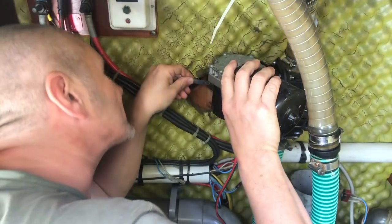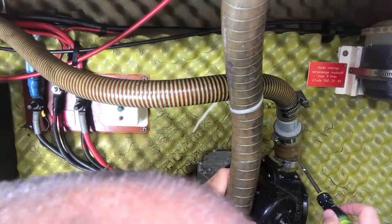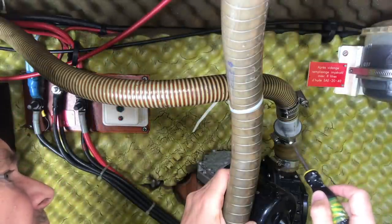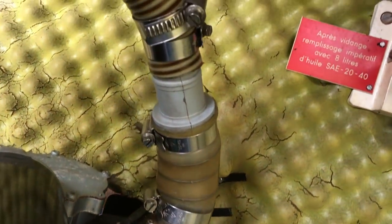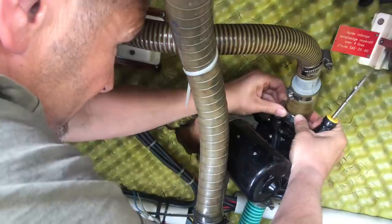Access is really tricky — it's bolted onto the bulkhead but the motor actually covers the bolts. What's a bit strange is there is a bit of an adaption going on here: there's like a reduction pipe here, it goes down from maybe 38mm to 25mm or something. Not sure why that is or whether that was done originally. I'm just going to disconnect it by the lower one so maybe I can take a look in there and see where this leak's coming from — make sure that jubilee clip doesn't end up down the bilge.